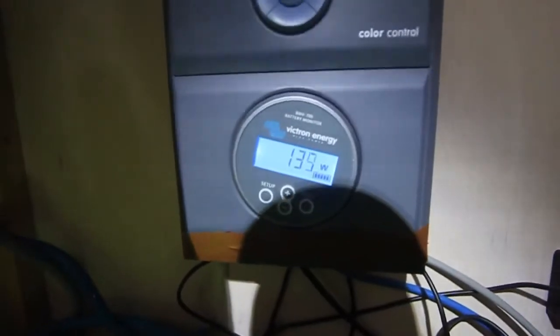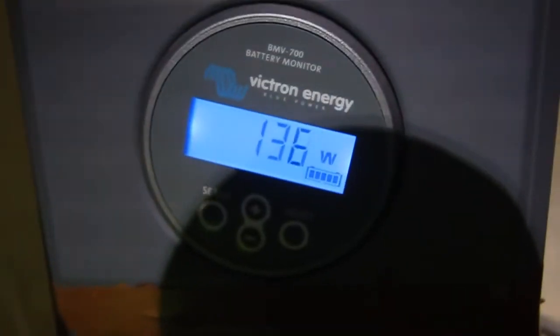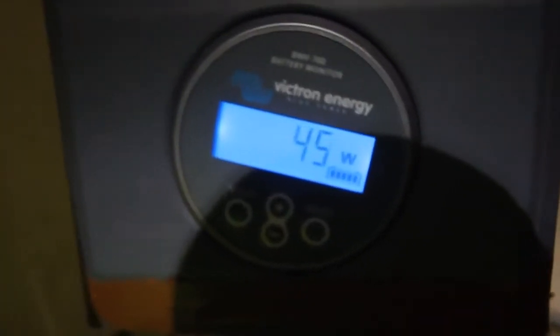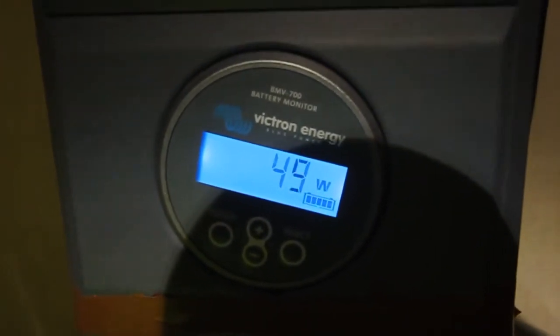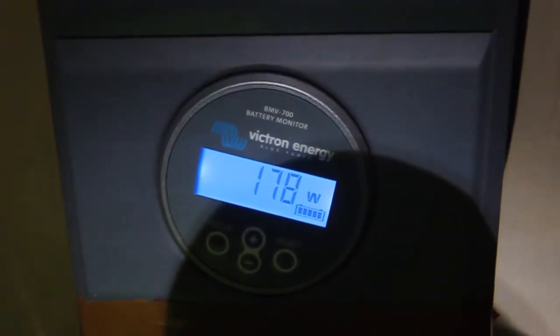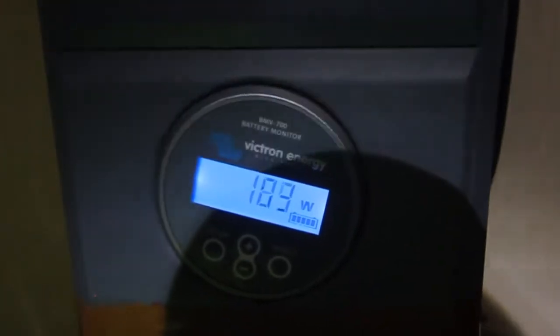As you can see, you can see watts also. From this number you need to minus solar and we have turbine power there — about 100 watts. In nominal power it's 1 kilowatt. Oh, nothing now, and again a gust is coming: 200, 260... and slowing down.